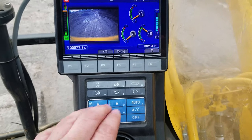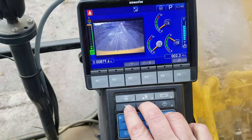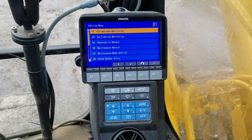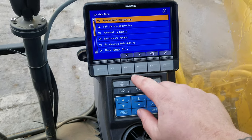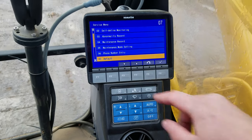To get the monitor on this one, it's similar to the dozer. Let's see if I can do it with one hand. The code is 0-4-1-2-3 — let go, there we go. It's in there. That's your code to get into the system on the service side.